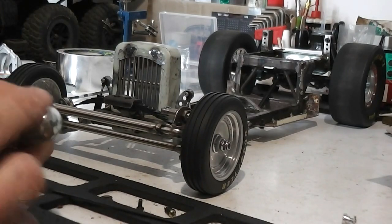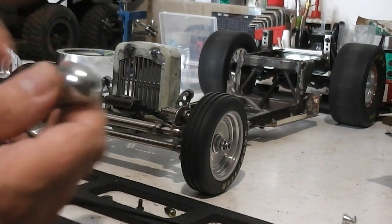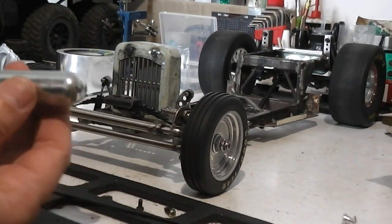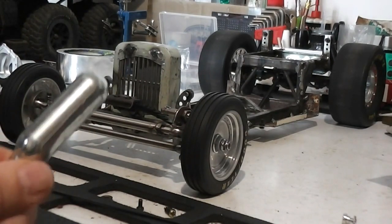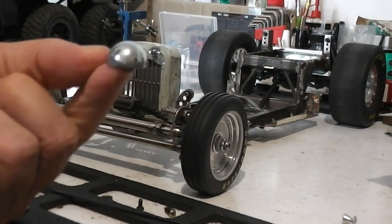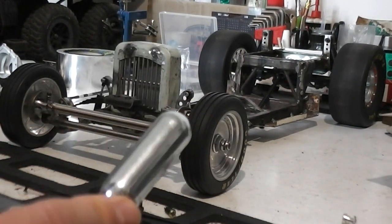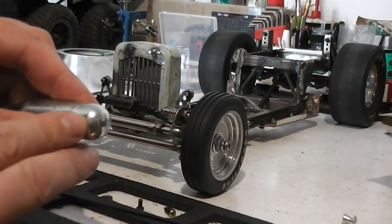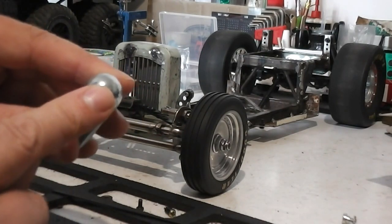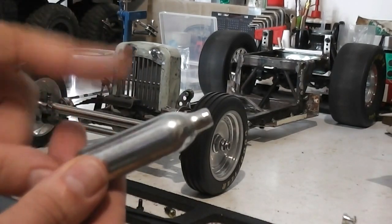But today, what I'll do now, actually, is go and drill the hole first, because one thing I've learned from watching the old boys doing their engineering videos on YouTube is don't cut your part until you need to. If I cut this real small, I'll end up with some little thing like this, and it's a lot harder to hold in the vise. So while it's a full cylinder, I'll stick it in the vise and drill a wee hole here, and then I can cut it off. I don't need to drill the hole in the back for the LED, because that's easier to drill from the inside, which is what I did with Fat Betty.